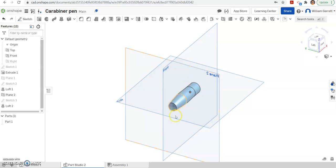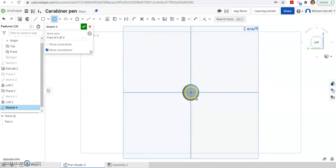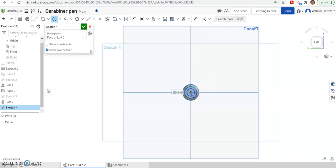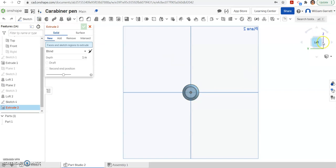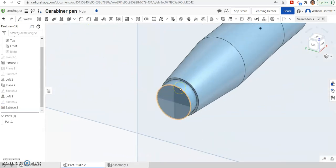Next I'm going to make a circle on the plane we just created. I'll hit sketch, go on that surface, and select a circle. Keeping it consistent, I'll change to the left-hand view and make sure we're on the origin. This time our circle is going to have a diameter of 0.575, and that sets it in place. Then all we have to do is extrude — green check, then extrude. Changing to ISO view, this time we want it to go a distance of 0.15. This is the portion where our threads are on the back-hand side, so that's just going to be that back-threaded portion. Hit green check to accept, and that gives us that threaded portion.